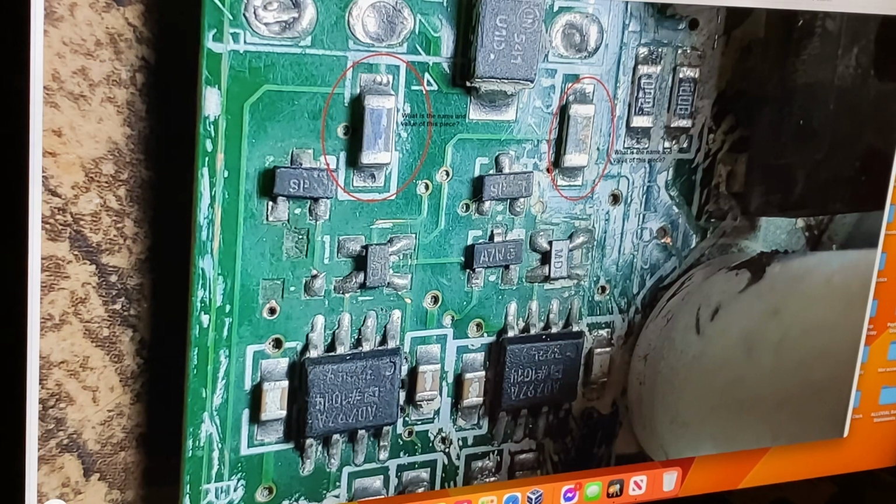It's funny, I've been doing GPXs and trying to remember back, because the GPXs don't use a P-channel MOSFET in this position here. They've all gone to N-channel MOSFETs, so they're using a series N type arrangement to block the flyback voltage and to block the transmit voltage, which ends up on the receive wires anyway, or ends up on the coil.